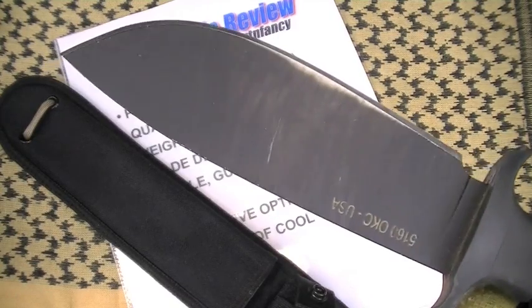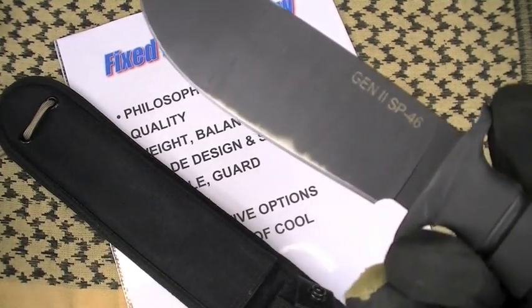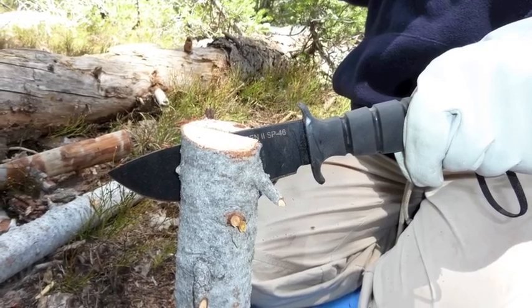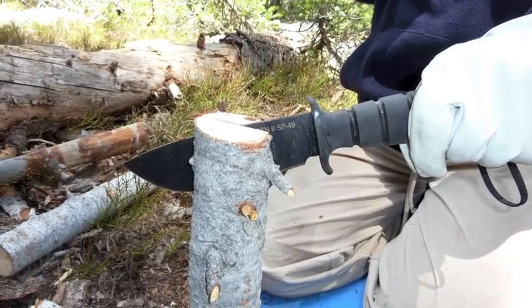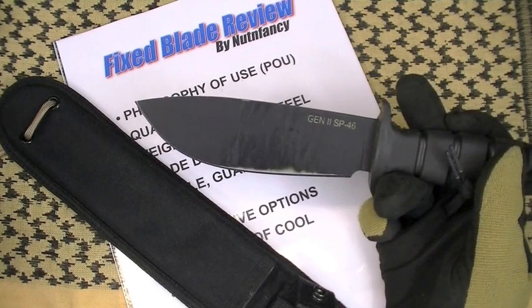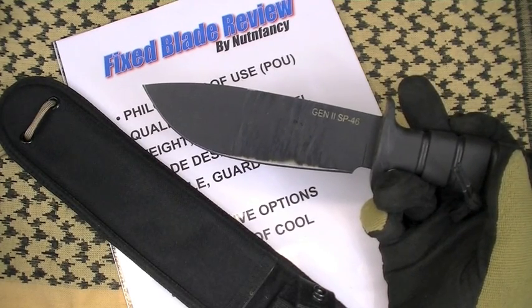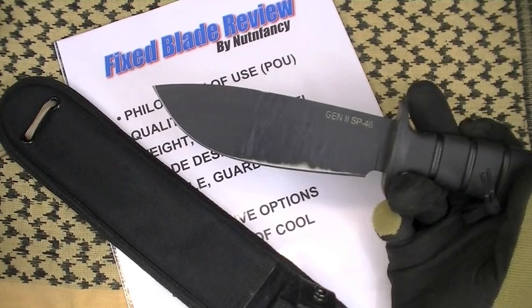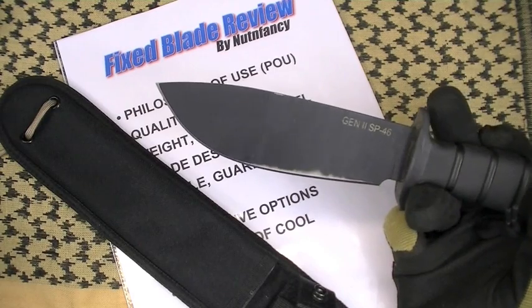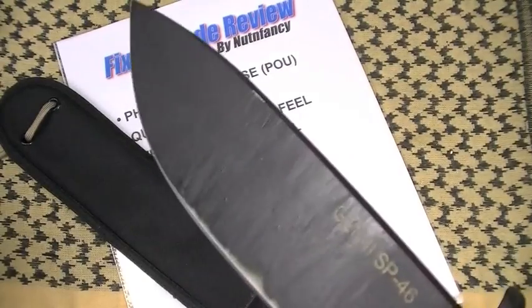Surface grind. Had about 0.030 per side ground off to eliminate any possibility of problems from the hot rolled surface. I once had blades made of 5160 from a large steel retailer crack due to cracks in the surface of the material from the hot rolling process. If you're getting the vibe that this guy put a lot of attention to detail in the design of these Gen 2 knives from Ontario, you would be correct. I dig it. That's why I'm reading him verbatim, because I'm so impressed with the amount of work and his very specific attention to detail in getting these Gen 2 knives right.